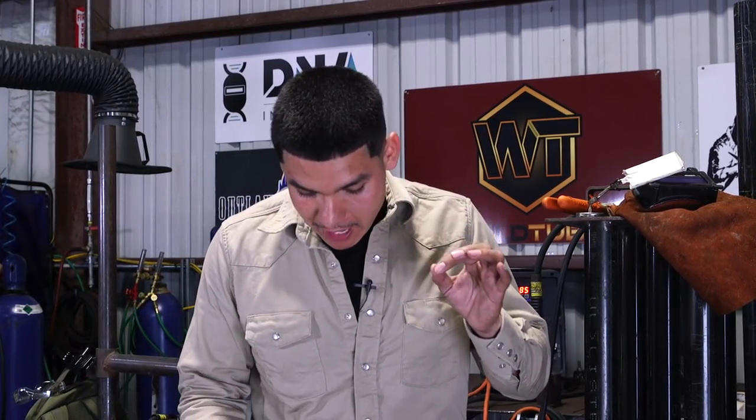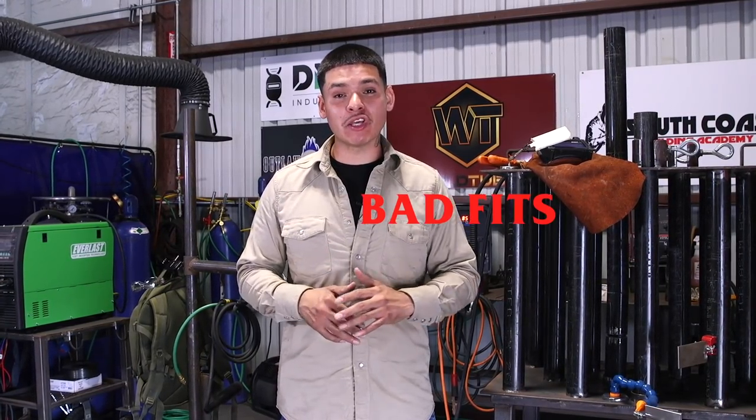Okay, guys, you went to school. You can pass all your tests. You know how to do 2G, 3G, 4G, whatever it is. You can TIG, stick. Whenever you master this, you want to start taking on some more restricted welds. Once you can put a bead with TIG through the top with no issue, you're ready to move on to these type of welds. I recommend you learn how to do this. It will help you out on the field, and it will keep you employed because there's not a lot of welders that can do real tight welds. Remember, guys, tight fits and bad fits make good welders.